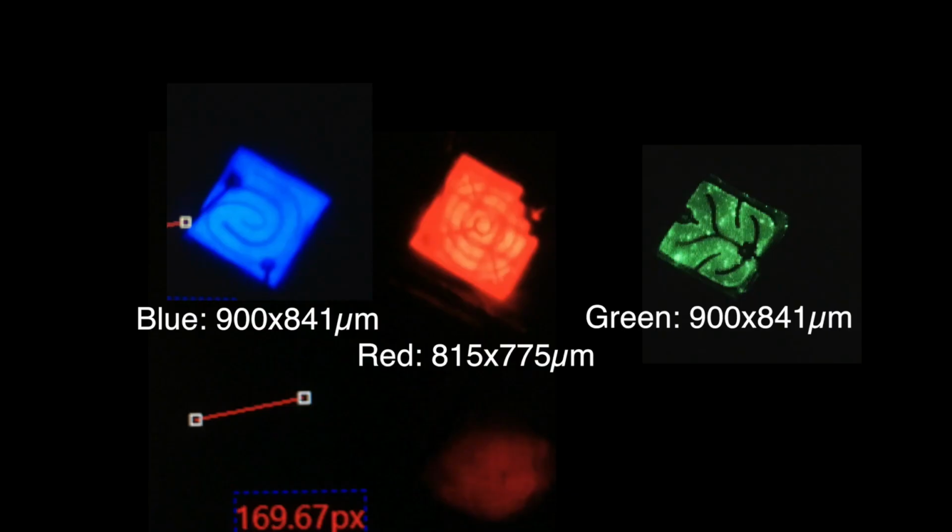When the LED is set up within the integrating sphere, we would change the voltage with this, and as you can see, as the voltage is being changed, the power is greatly increasing. Our dark reading was 81.8 microwatts, and with the laser set up in the integrating sphere, we now have a reading of 82.8 microwatts, showing that the laser is very low powered.